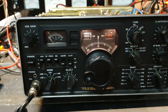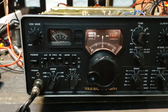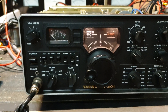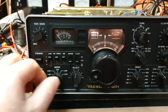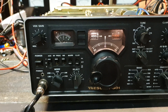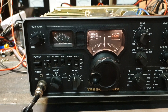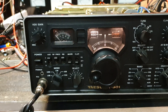This video is really about the troubleshooting process. The process here was: first, find out if there's audio — no there's no audio. Is that because the receiver is dead, or because the audio IC or transistors are dead? We proved it had a signal coming through and was receiving quite well. Then we checked: have we got transmit? On sideband we would have said no transmit, but the common denominator is that many radios source their audio for the mic transmitter from the same audio IC or transistors.